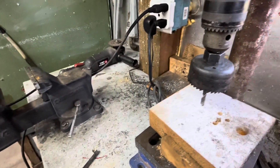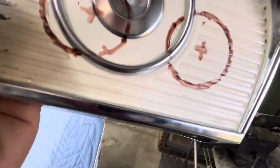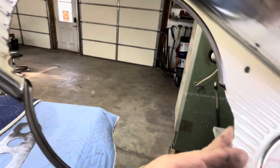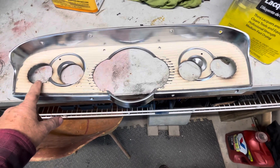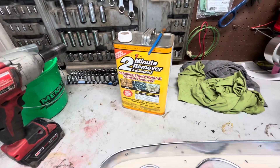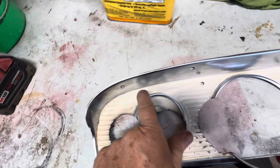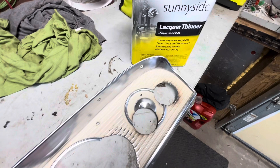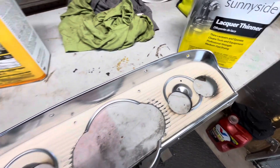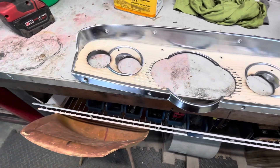Both larger gauges fit through — I think we're good. Got the hole saw and a drill press, with my circles marked with an X in the middle. We got the four holes cut out. Now we're using some paint stripper because the white shows through on the aluminum in the corners, so we're trying paint stripper — we think that'll remove just enough so you won't see any more white. It says two minutes, we'll see if that's true.